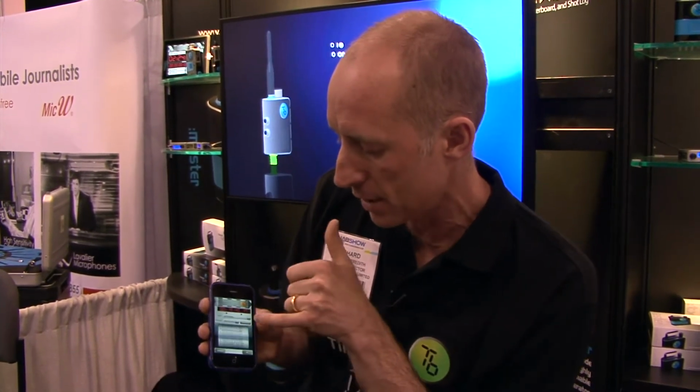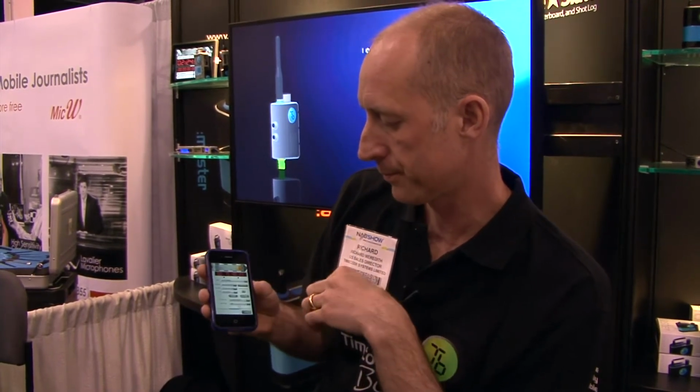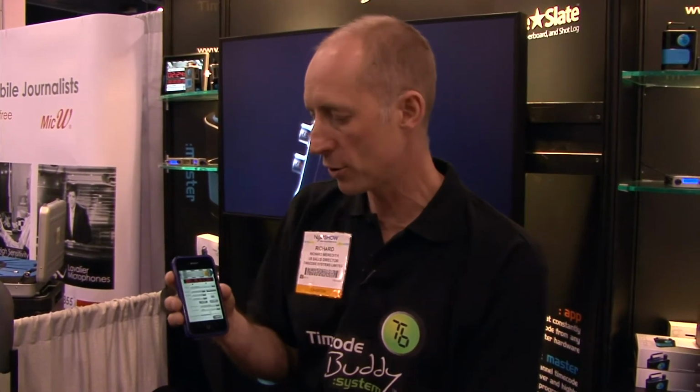So that will have just changed over to 29.97 drop frame, which it has. And we can transmit over any one of, as I say, any one of 14 frequencies. So I'm going to choose channel 9. So again, a very quick way to navigate your way around the functionality inside the master from the remote control.